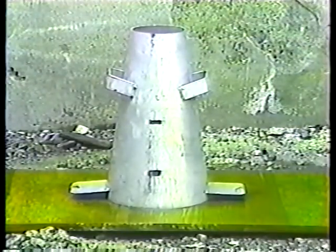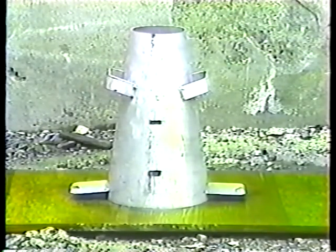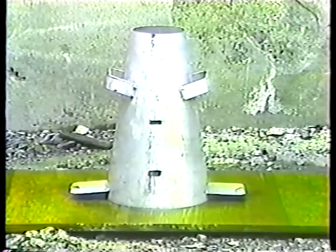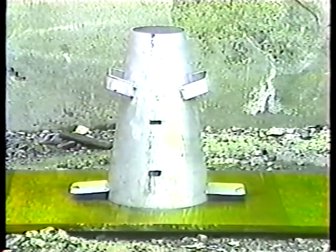Place the cone down on the base, as close as possible to the concrete sample. Make sure the base is level and firmly supported. It has to be flat and stable. That's a must. The person doing the test should step onto the footholds at the bottom to hold the cone steady and stay there. That's why the cone should be close to the concrete sample.